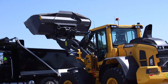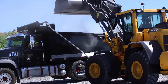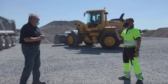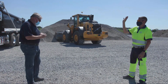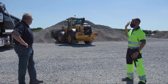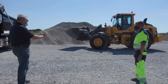So we'll watch Tyler approach the truck. What was that all about? A little rough. So what did you do wrong? The first load going into the truck is really crucial. You want to make sure you're centered and you want to have a slow steady dump in there. It can be a decent speed but we don't want to have the load shifting to the far side of the truck — we want it in the center so the truck's not unbalanced going down the road. It's nice and tight as well, I see.